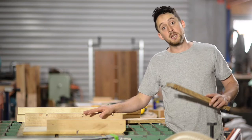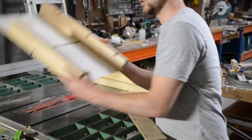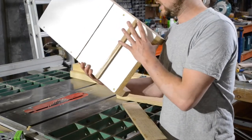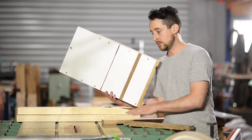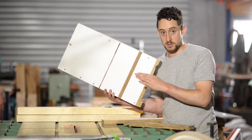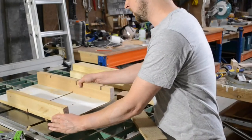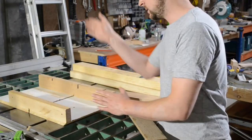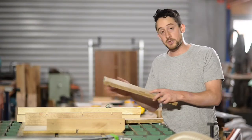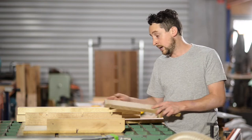In order to do this safely and efficiently, I have just used my little cross-cut jig. I'm not going to go into how to make this. If you wanted, you could even just clamp some stock square across the blade and raise the blade up until it was high enough. The basic principle is this jig sits perpendicular to the direction of the blade. It allows you to do accurate cross-cuts that are exactly 90 degrees to the blade.